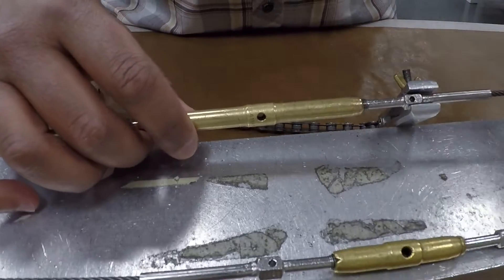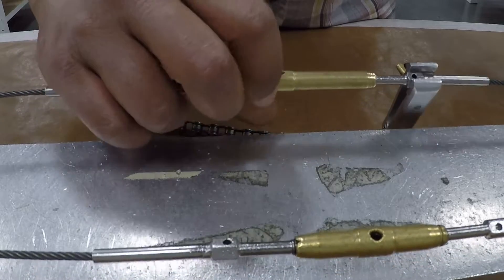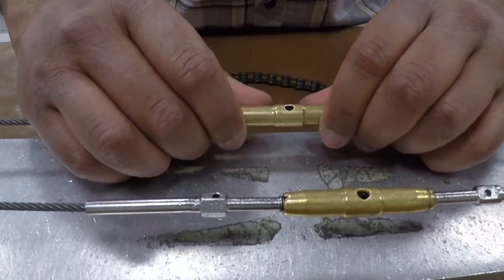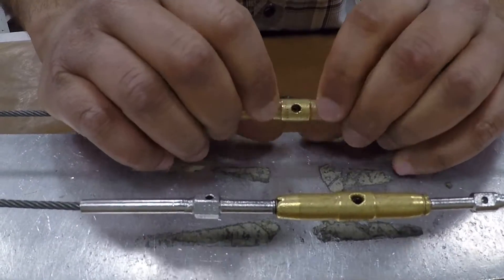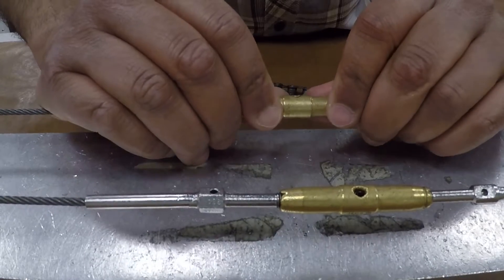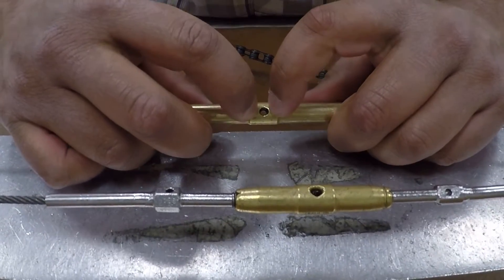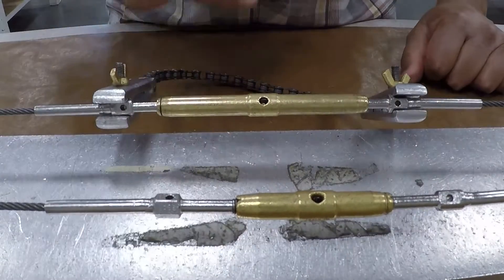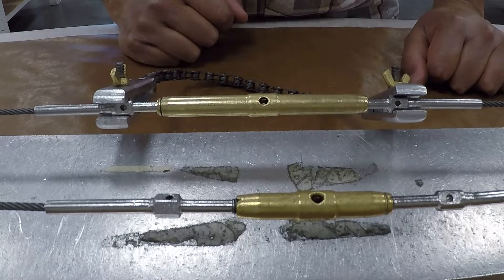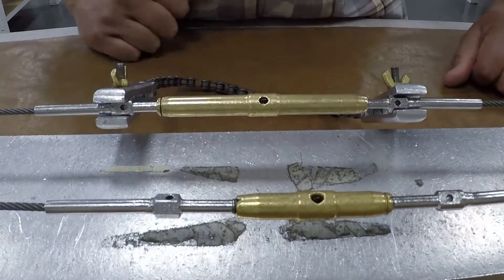You will also need to have the turnbuckle cable clamp installed for tightening as well. You can notice my cable is not twisting as I'm tightening up the cable. Now when you need to tension your cable, you're going to do so with the turnbuckle. If you get to a point where you can no longer turn the turnbuckle with your fingers, there's a convenient hole in the middle of the turnbuckle — just get your pin punch, stick it in there and let it help you turn the turnbuckle. You can also do that for removal if it's too tight to loosen.